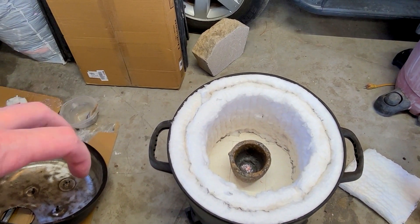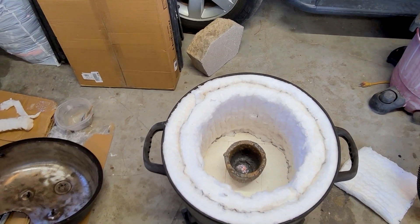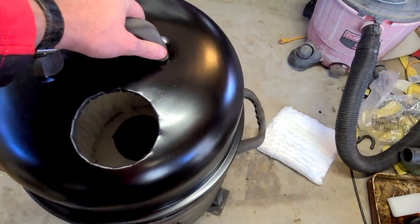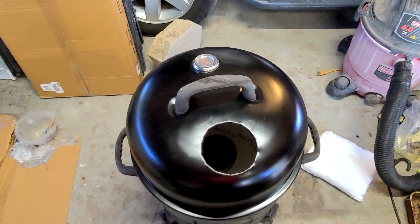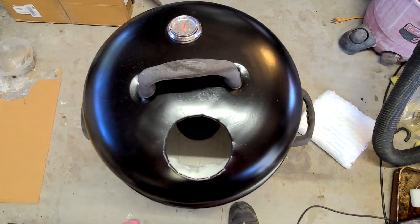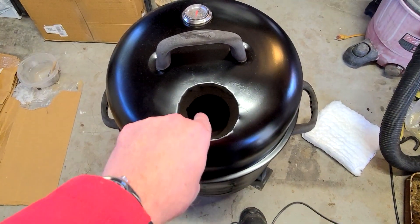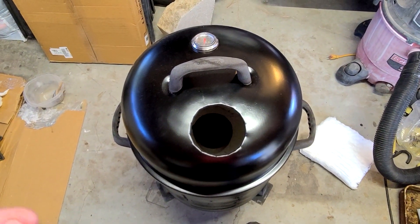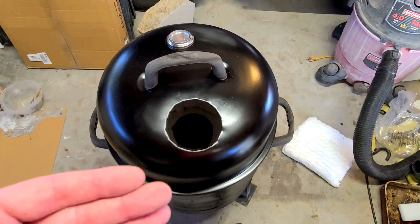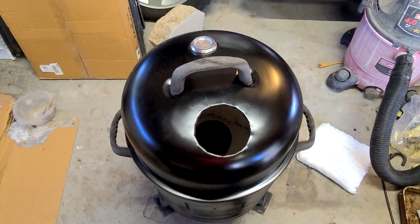What I'm going to do is a kind of cinnamon roll — I'm going to roll the insulation up so it kind of friction fits in there, and then I'll use the sodium silicate to kind of glue it in there. Now the one other issue we're going to have is the hole is not centered, because I wanted to keep my handle even though it may melt — we'll see. If I just bore a hole through the insulation straight down we're going to hit the other insulation, so we're going to have to do it at an angle right through to where the crucible sits in the center.